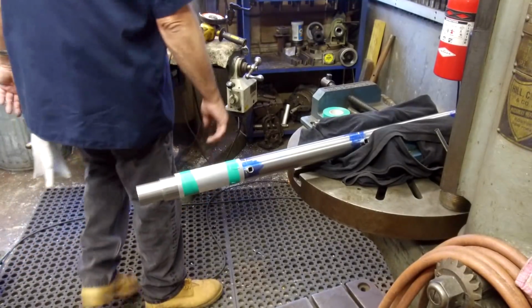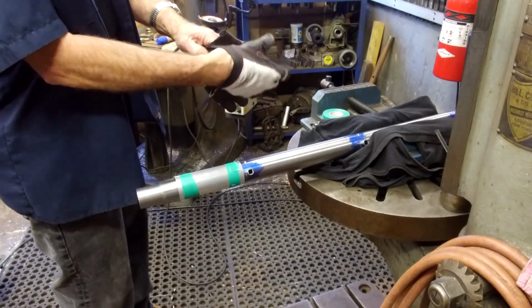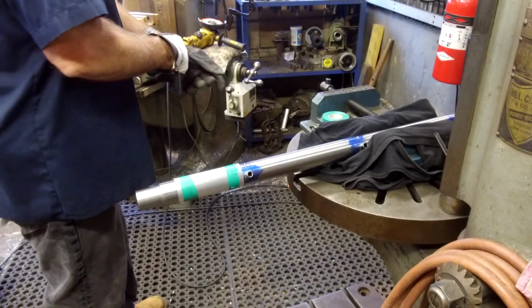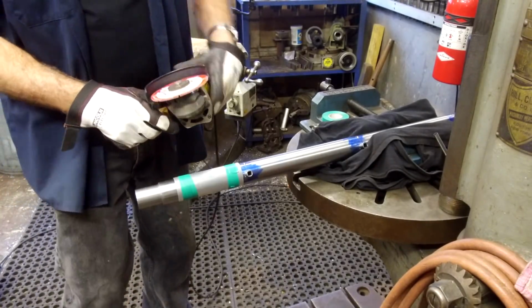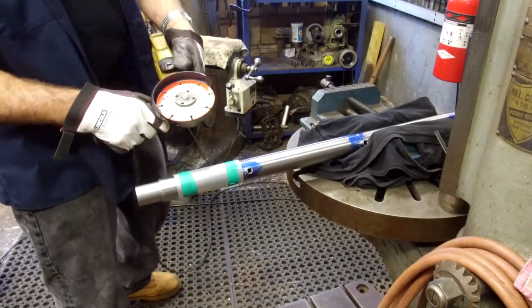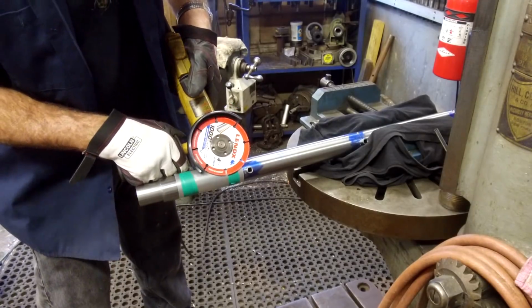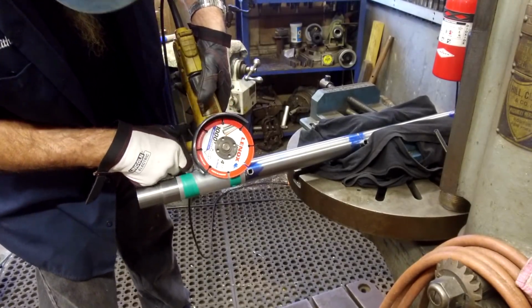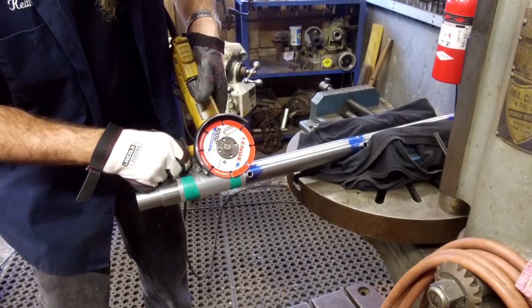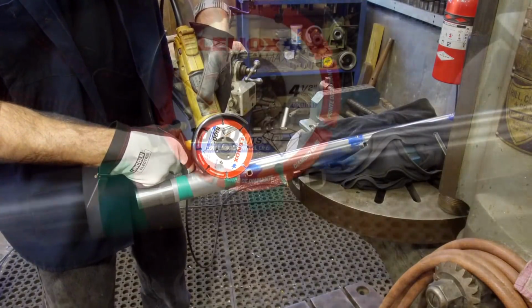All right. Let's get some gloves here just in case I'm holding my hand where the sparks or whatever. We're choosing this blade and this area here because it's not the regular abrasive wheel. It's got the diamond edge on here, and we're looking for less dust in this neck of the woods in our shop. So test run, just make sure everything is fine here. Okay, I'm going to come down here, and am I actually going to get that full depth? It's going to be close. All right, let's give it a shot here.